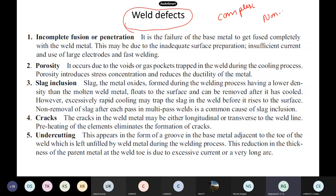There are non-destructive techniques such as ultrasound and magnetic particle testing. Without doing anything to the existing weld, you do ultrasound — like how they do inside our body — and try to identify whether there are any cracks or what type of failures have occurred. These methods are used because visual inspection alone cannot reveal internal defects.